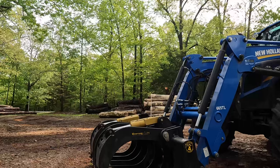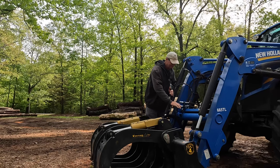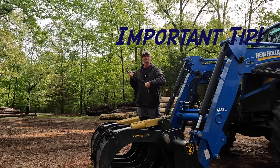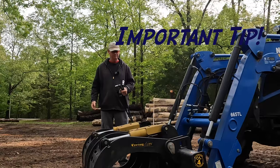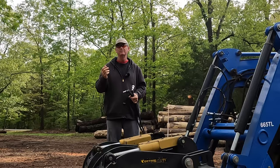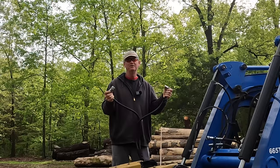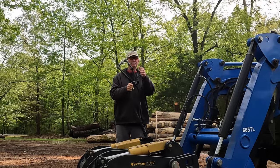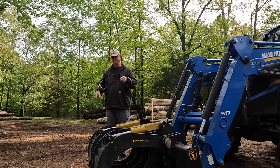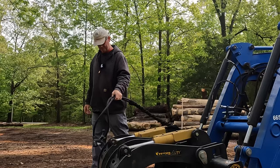First, I need to take the claw off of old blue. Here's a little trick - have you ever had an attachment with hydraulic coupling? You know what a total pain it is. The pressures in the cylinders heat up and cool down and you can't get the connectors to connect to your tractor, front end loader, or skid steer. That's because one side of the cylinder may not have equal pressure. What you do is pretty straightforward: take the two connectors at the implement and put them together. Now the fluid can flow in a complete circuit and you'll never have issues with stubborn implement hydraulic connectors anymore.